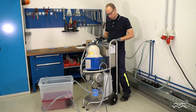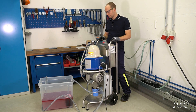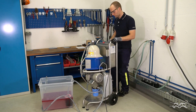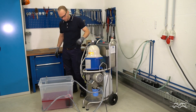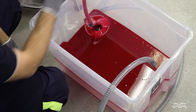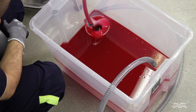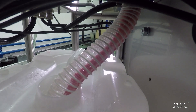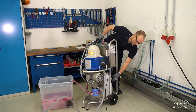I'm ready — I will press play and see what happens. The separator runs up and adds some vibrations for a very short moment. Now it's up to speed and the pump kicks in. You can see that the red oil is getting sucked into the separator, and very quickly it should be visible that oil is being separated into the tank here in the back.